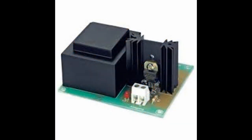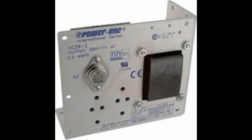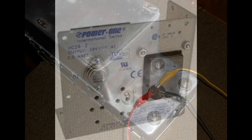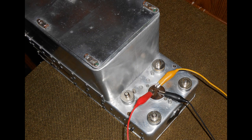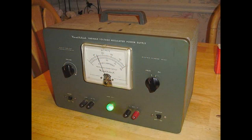The recommended power supply for the set would be to apply the filament voltage. We want to apply the filament voltage for about 15 minutes, and you're going to feel and see if all the tubes are warm. You want to make sure you don't have any tubes with open filaments. I've had two of these that had 12SK7s that were open. Sometimes the 12A6 can open as well.